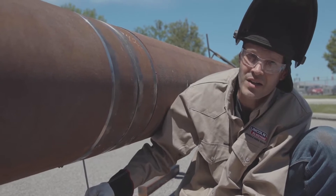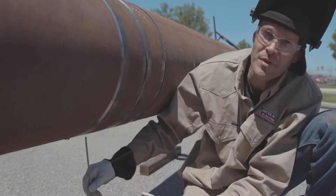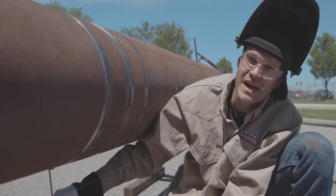If you see that, read the puddle and adjust your rod angle. Another thing you want to avoid is stepping — you don't want to whip the bottom. You want to do just straight, nice, smooth stringers coming across the bottom.